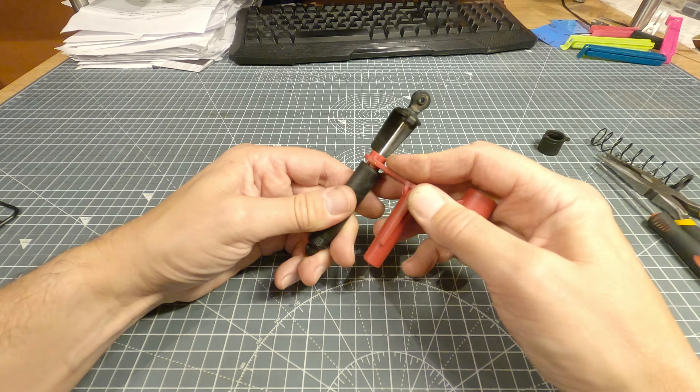I'm not going to go in at the top there because that doesn't get in the way of anything — going straight across the top will be stronger. It's pretty useful if you've got a vice to hold the metal in. I'll stick that in there and use my junior hacksaw to cut it out.